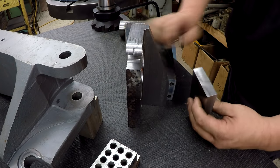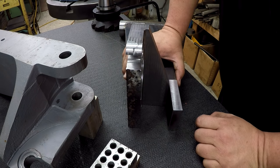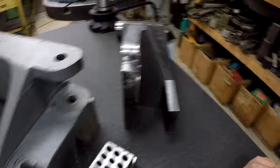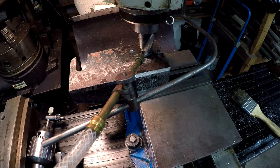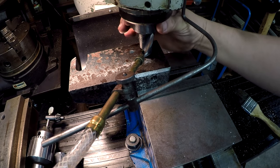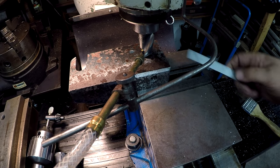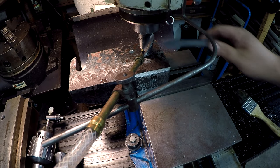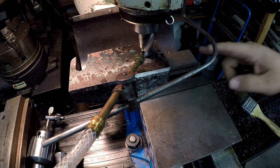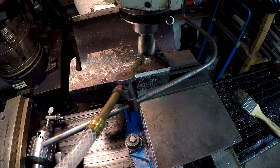We got this one milled to size; I just need to put the two holes in it and a hole in the center to line it up on the rotary table. While I'm set up here I wanted to do this hole — that's where the pin's going to go through. There's actually a counterbore on the backside where a snap ring holds it in and keeps everything flush on the bottom. I'm using an inch-and-a-quarter two-flute end mill and it plunges one-eighth deep. Hopefully the little do-all will handle it.